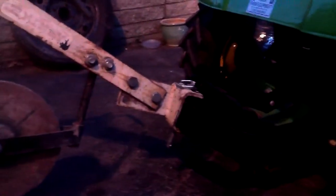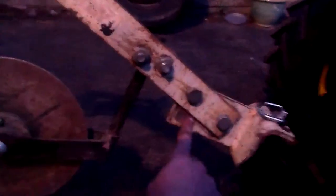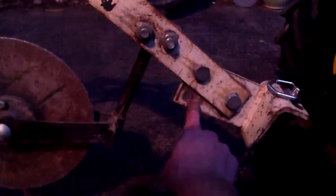The Case can handle a plow like that no problem, as can this tractor I'm sure. I just threw it on here for a minute to see what it would look like. I would need to set my sleeve hitch to lift higher - that's easy, I've got two more adjustments to raise it up. And I would need to lower the plow here, drop it down to one of these lower holes for it to work properly. I do have this angle adjustment that just lowers or raises the plow angle, and that's about all that does.